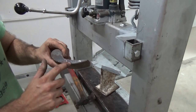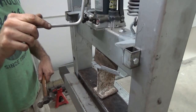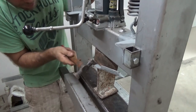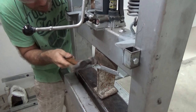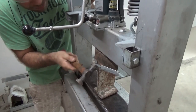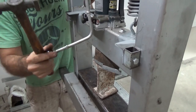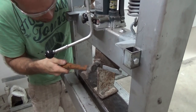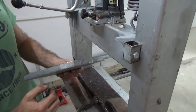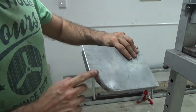Now we will use this elliptical dolly to smooth out from the round shape onto a straight part over here. For the corners we have some overlaps which we will trim with a grinder. After the trimming we can weld them together. The item is almost finished after welding and dressing. The result is pretty nice.